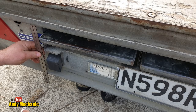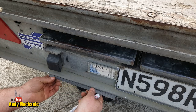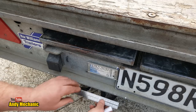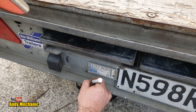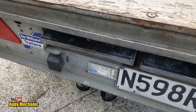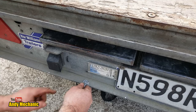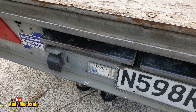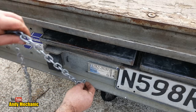We'll just mark down on the base — the ends are there. How wide is that? Going to be 34, so that's 17 from one end — should give us a centre point. I always mark my centres with a C, just to remind me. I would say probably a hole somewhere around about there. We'll use an M8 bolt with a nylock and a couple of washers to secure that chain in place, probably on top because I want to minimise the amount of stuff dangling down at the back — there's more chance of it catching on undulating terrain. Some of the driveways in New Zealand are pretty steep. So we'll drill an 8mm hole and bolt that bit of chain on, then we can measure how long it needs to be.